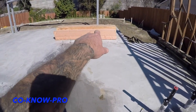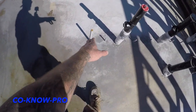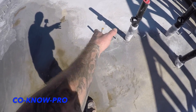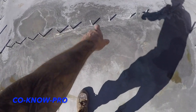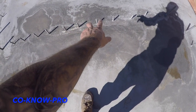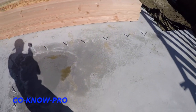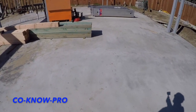All our six-by-six posts are going to be attached to every single one of these big pieces of one-inch all-thread, which are my HD-11s or HD-14s. You can see all our hold downs and all our J-bolts. You see how many J-bolts we have right here? That's because that's a shear wall — probably a level five or six — which calls out for J-bolts eight inches on center.